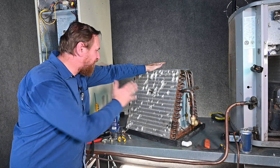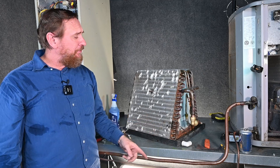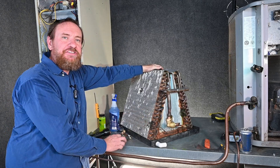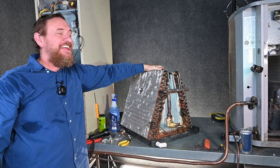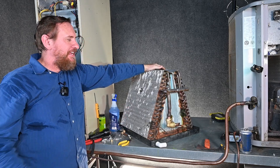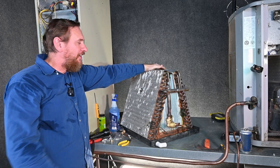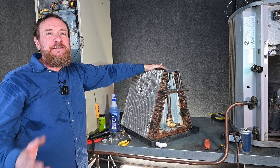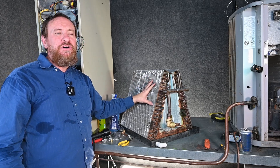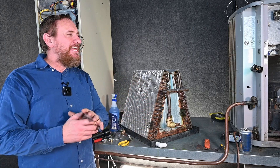These are just some of the things to work with. Before you try fixing a leak, go practice on the junkyard stuff first. Think how many times you could practice on this coil — all of these fittings, all these connections. If you really want to get good, take these U-bends out completely. If you want to have fun with it, try cutting this metal loose, because sometimes they'll leak right where the copper and the metal touch — practice cutting that metal out and try fixing a leak there. The junkyard at the shop is a great way to practice. Get your hands on it before you ever have to need this in the field. On commercial systems, there are going to be times you absolutely, without a doubt, are going to be fixing leaks on evaporator coils and condensing coils — you have a different set of rules, and you're talking about food over comfort. That's just an example of what you're looking for, how you would pressure test an evaporator coil, and why we can use higher pressure.